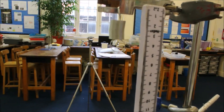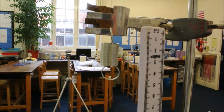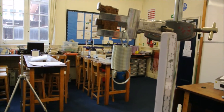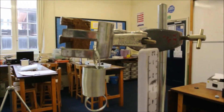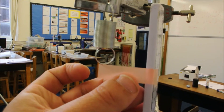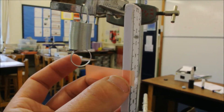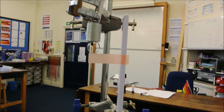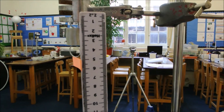To avoid errors when measuring the length of the spring, we need to mark where the very bottom of the spring has come. I'm using small post-it notes — I'm going to find the very bottom of the spring, making sure that's horizontal, and then read that measurement off the side.